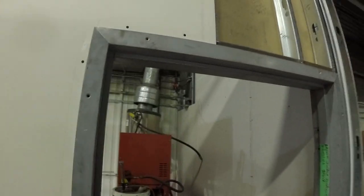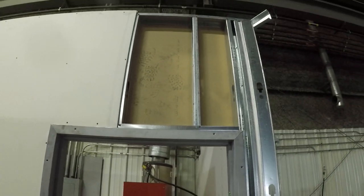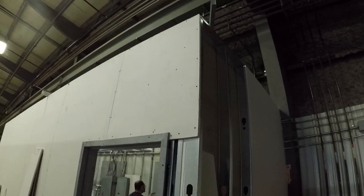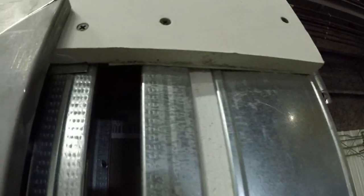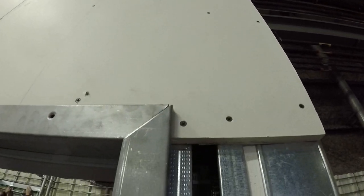On the second door that I put in here I go into a lot more detail. This is just kind of the quick door so people can get an idea of what we're doing, and then I break it down further on the next door frame. You see there's a half inch spacer on the bottom — always using that half inch spacer. The frame, the board is tight all the way around the frame. I put the big piece in there. You don't put in bucks if you can get a whole piece — it's called a hook piece. If you can get a hook piece in, great. But a lot of the times you can only get one of those on, and then the next piece will be a buck.